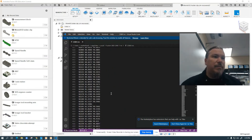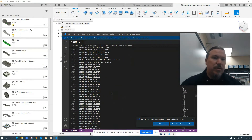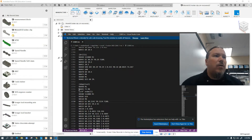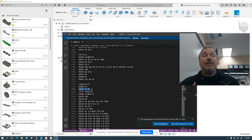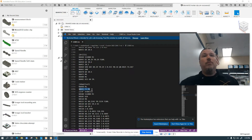The tool changes all look the same way. There's a tool listed, but it's going to an M0, which means it's not actually executing a tool change — it's executing a program stop. When you hit this, it's going to stop the machine and you have to change the tool in order to move on. Save your code to a USB drive using the post I showed you and we'll get to the machine next.